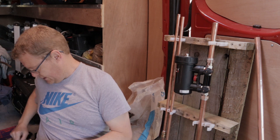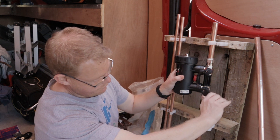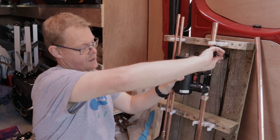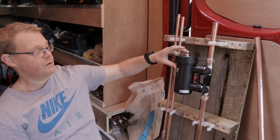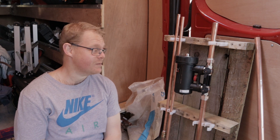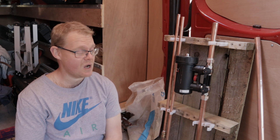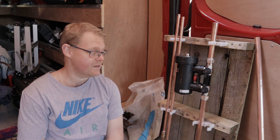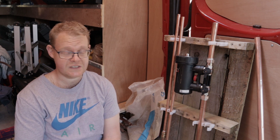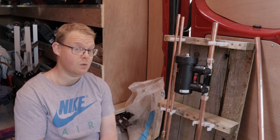Once you've done that, you're going to want to test it for tightness to make sure it's not leaking. Turn these valves back to on - from red to green. That valve would then be live again, then bleed the canister with the bleed at the top. That is how easy it is to fit one of these. They are a good piece of kit - such a simple design, and I think that's why it works so well. Just a magnet in a jug, it pulls out all those magnetic particles. It's protecting the whole heating system, not just the boiler - everything coming back on the return from the radiators would eventually pass through and it's collecting debris from that as well.